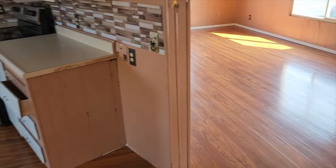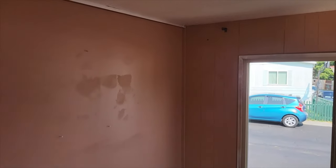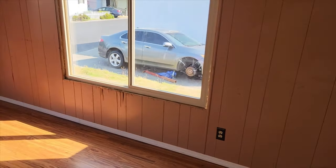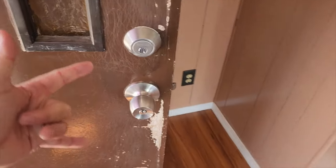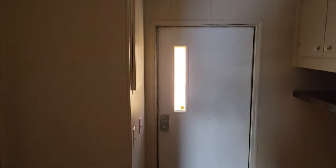What we're going to do today is a couple of things. We're going to take everything out of the walls in this room so we can start prepping for paint. My daughter-in-law is ready to paint this room. We have to pull all the baseboards, take all the plates off, take all the screws out, fill and sand all the holes, and then get it ready for paint. Also this house didn't come with any new keys, so we're going to replace the doorknob set on the laundry room door. We're going to replace both doors, and I have a digital lock so they can come in and out without needing a key.